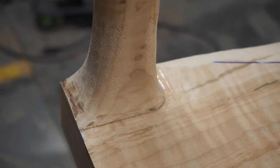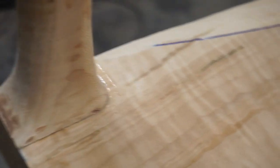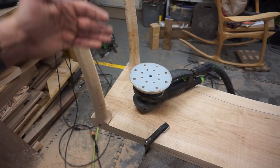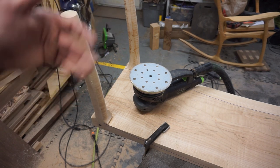As you can see, I've gotten in a little bit closer — the transitions on the leg look fairly smooth. You can still see there's a bit of a lip here that I will get with the sander. I'm going to use my RO 150 with 80-grit paper to show you how I transition it.